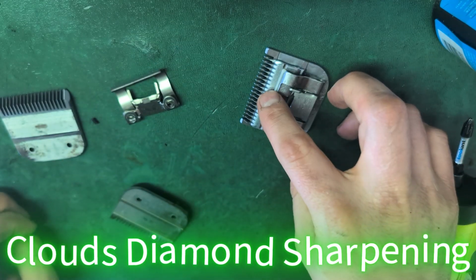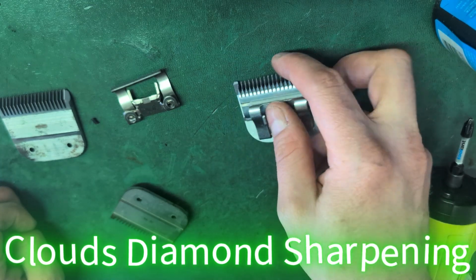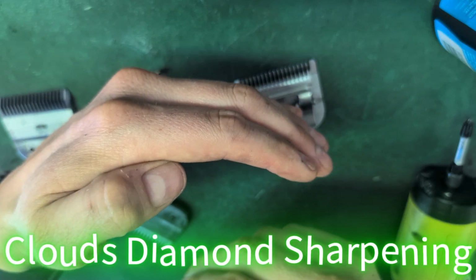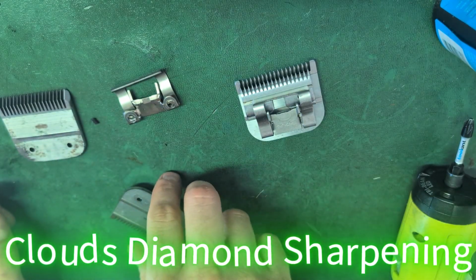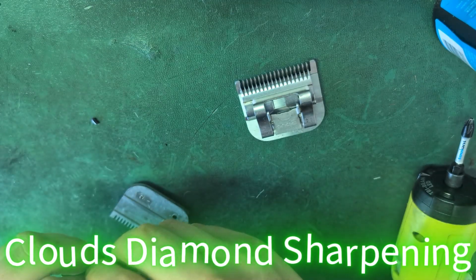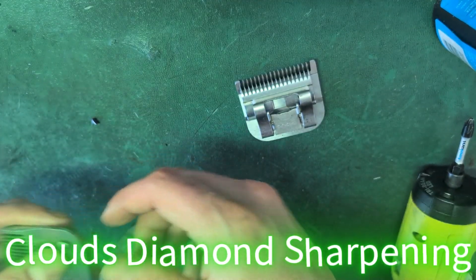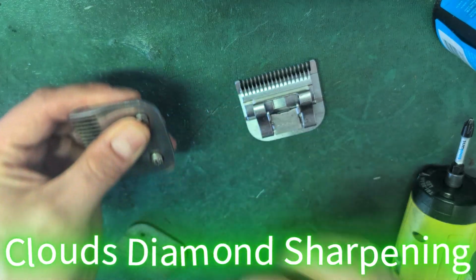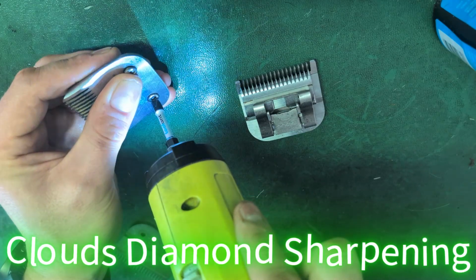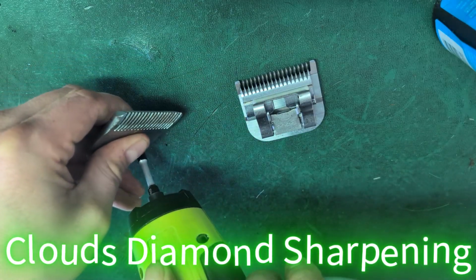But you can't just sharpen the teeth and expect this blade to cut. It's sharpened from the bottom and it's hollowed out. So it's like that and then goes like that when it is used in hair. It eventually flattens out, and then once it goes flat, it is dull. That means the sides will probably pull first. Sometimes the middle does, but in general, the sides will pull. And the hair needs to not be pulled anywhere.